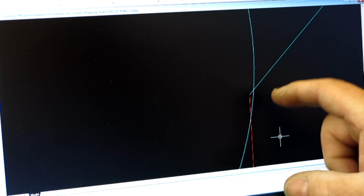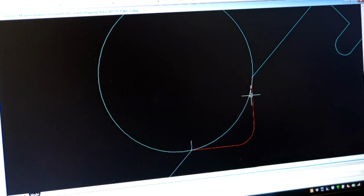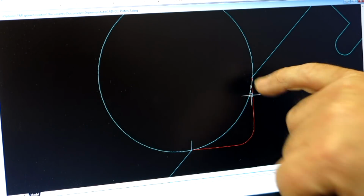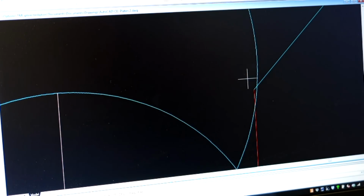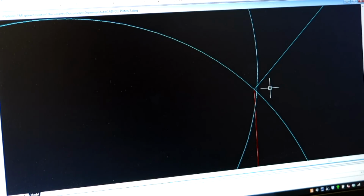So now what we need to do is rotate that pin on that corner until it's just touching that corner. So how do we do that? Well, an easy way is to draw another circle from this point right here, and draw it to intersect right through there. All right, so now that's the path that this pin is going to move in.